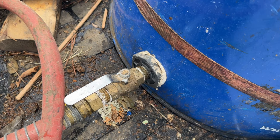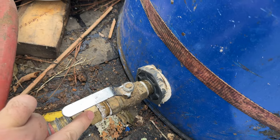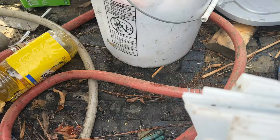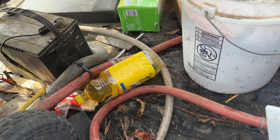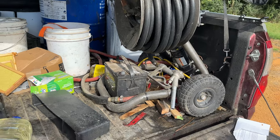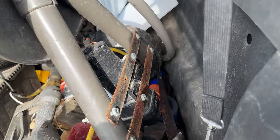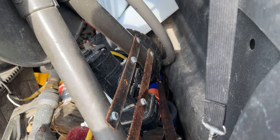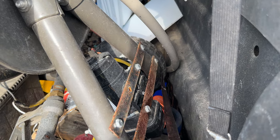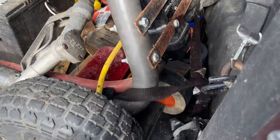The outlet of that bulkhead fitting is threaded three-quarter MPT. I went to the hardware store, got a three-quarter MPT ball valve, and then a fitting that changed that over to garden hose thread, and I cut a piece of garden hose — that takes it into my pump. Syrup flows from the tank through the inlet hose, and I've got a FlowJet diaphragm pump. This is a FlowJet 04-300-504A. It cost me about $207 on Amazon, and I just mounted this onto my hose reel.